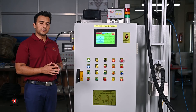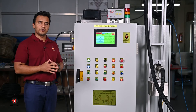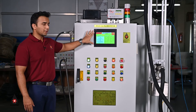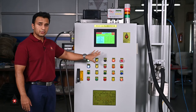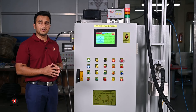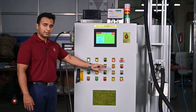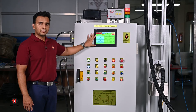The fourth sub-assembly is the electronics and electronic control, which forms the brain or central processing unit of the system. On the front of the machine is the standard HMI panel — the human machine interface — which is the primary point of interaction between the operator and the machine. There are also useful buttons including a main emergency stop, and others for auto cycle, selection between auto and manual modes, preparation cycle, and suck back cycle. The operator can command the machine using these buttons as well as through the HMI.